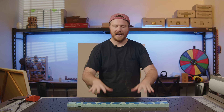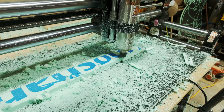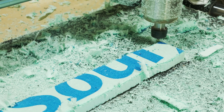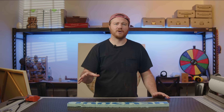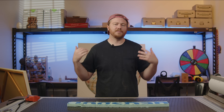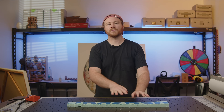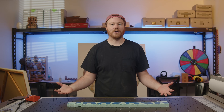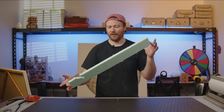Obviously I would not rely on parts this small being worked on with your CNC machine without masking the other area so that it had full suction — as you can see, only half of it was really suctioned down towards the end. This end was really floppy and I think that's because this material was not completely flat when we started. Normally your material is not going to be completely flat, but even though this one did have a slight bend, I turned on the machine, pressed down in different areas, and it all suctioned down giving me a really good clamp. Honestly this result is way better than I could have hoped for.